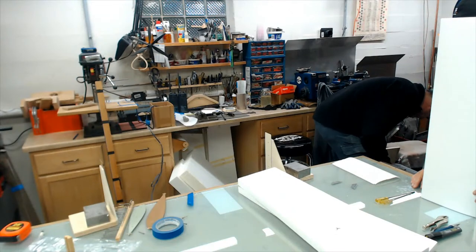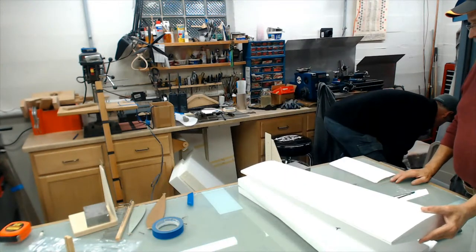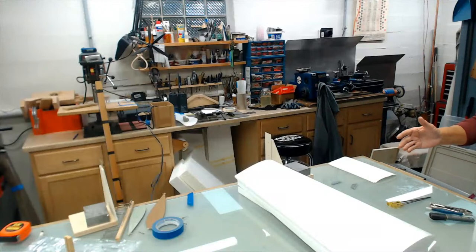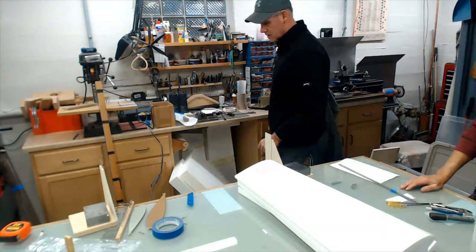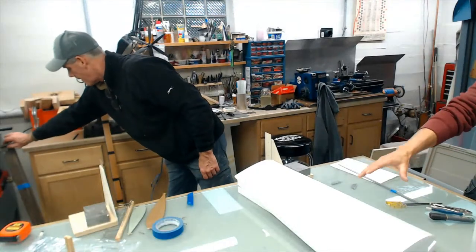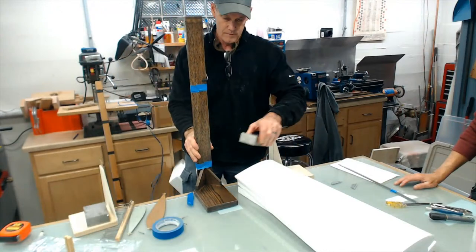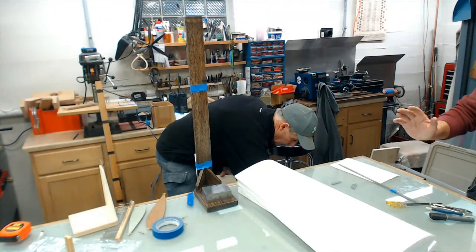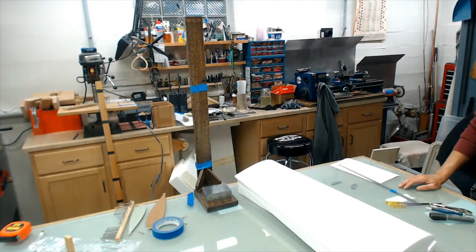There was something with coring these things. Now, if you're going to build a fully sheeted foam wing, which most guys do, a lot of guys will go ahead and sheet the wing right now and then triple core it. When doing that, you can weigh it down with a ton of weight, or if you don't have weights, you can vacuum bag them in the shucks.